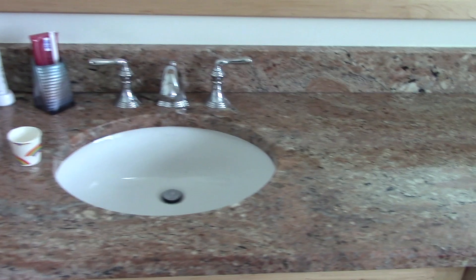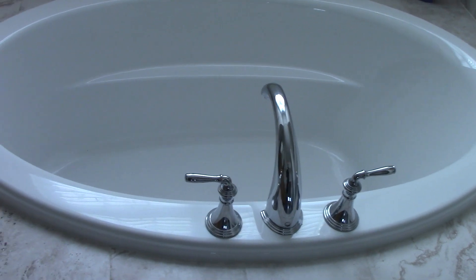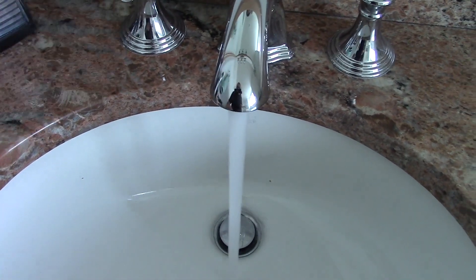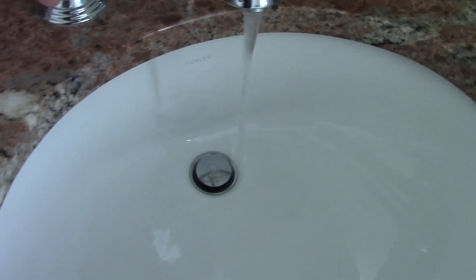Over here in the first floor master bathroom I have actually three faucets I can use. You only have to use one, but I'm going to use three just for the sake of giving a little bit more air. So we're going to go ahead and open up the hot water. Any hot water faucet that you open, you want to remove the aerator, and the reason why you do that is because later on when we're refilling, you want the water to come out freely so in case there's any sediment in there, it gets flushed out the line and not get caught in the aerator. So whatever faucet you open, remove the aerator from it.